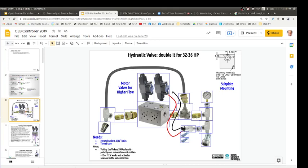Yes. That consideration is all solved by the size of your hydraulic reservoir. But remember, say you're going to pick up a backhoe attachment, and it's got big cylinders. All that fluid is in there already. The amount of change of fluid is only the differential between the extended and closed position, because if you're pumping it one way, it's going out the other. The only thing you have to account for is the difference in one way compared to the other, and that's only the diameter of the shaft of a cylinder. For hydraulic motors, it doesn't matter if you're spinning one way or the other, the fluid that comes in is equivalent to the fluid going out.